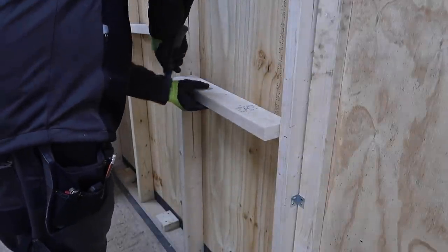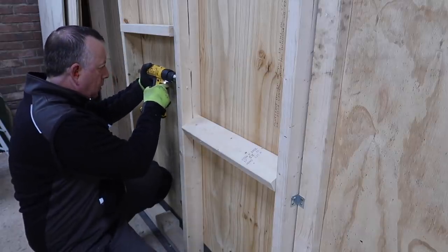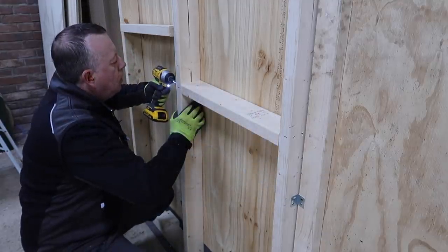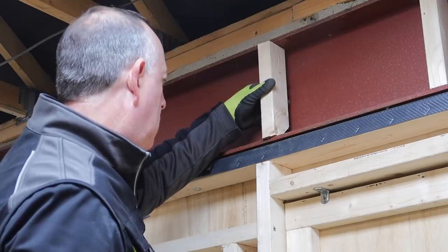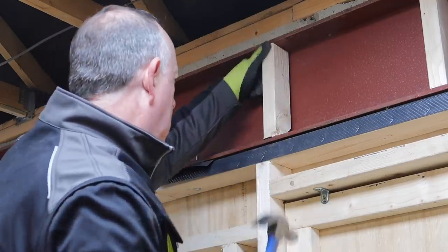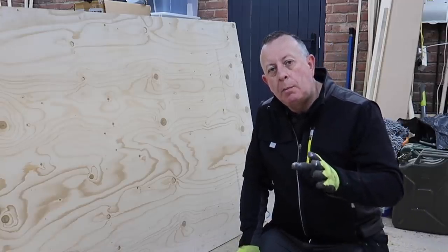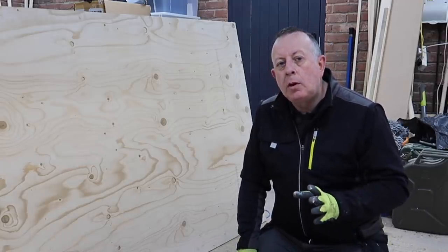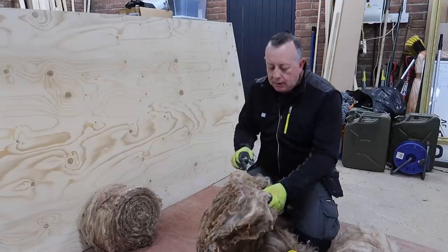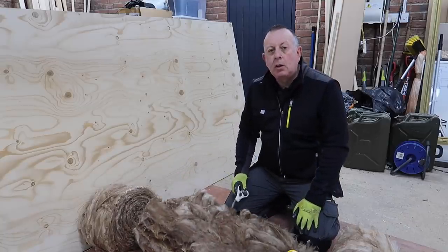On the inside, before I installed the insulation, I decided I might in the future have a workbench or tabletop up against this wall, so I installed some more 2x4 framing at the same height as my current workbench, which will give a future structure better fixing. I also put some noggins in the beam at the top just to help fix the ply that's going to run past this beam up to the ceiling. I didn't end up with rock wool in the end — when I finally went down the shop to buy some it was a lot more expensive than I thought, so I ended up with this cheaper stuff. It's really hairy — I'm not sure what it's called but I call it Chewbacca.